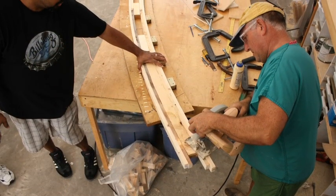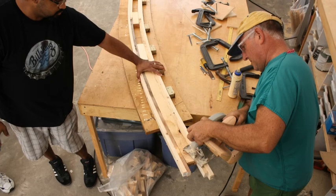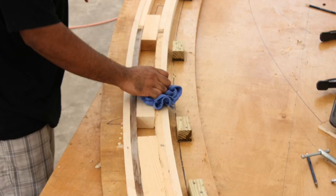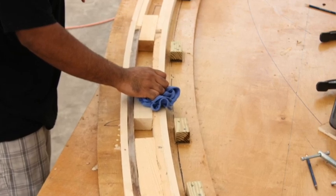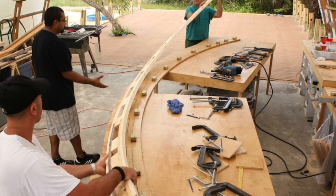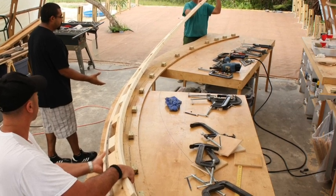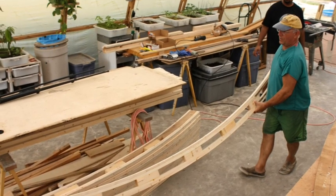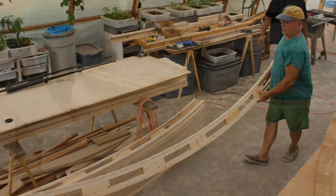Because we were pretty liberal with the glue, after the cuts were made we wiped down the arches so they don't stick together when you stack them. Just wipe off the excess — it'll save you some trouble later. We carried them over and stacked them up. For this expansion I put an arch every 4 feet, so I needed to build 14 of these.